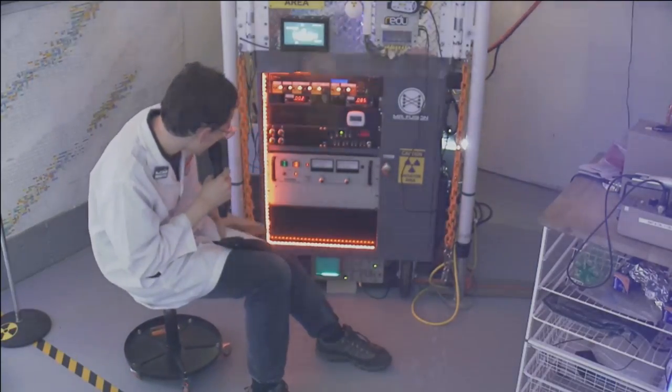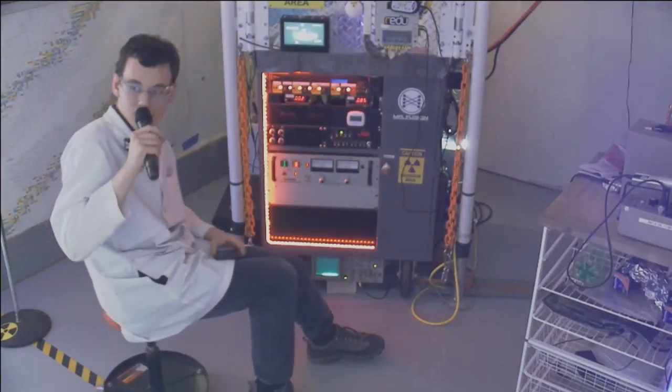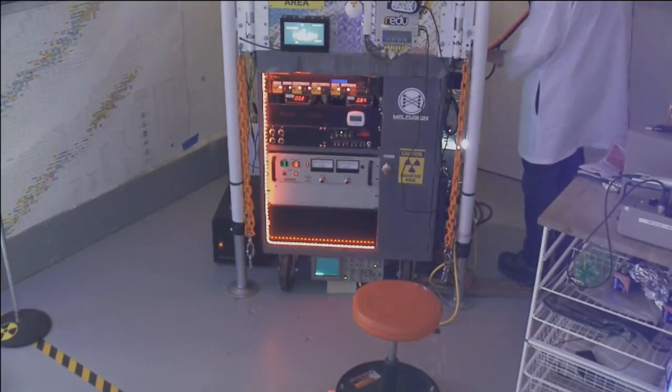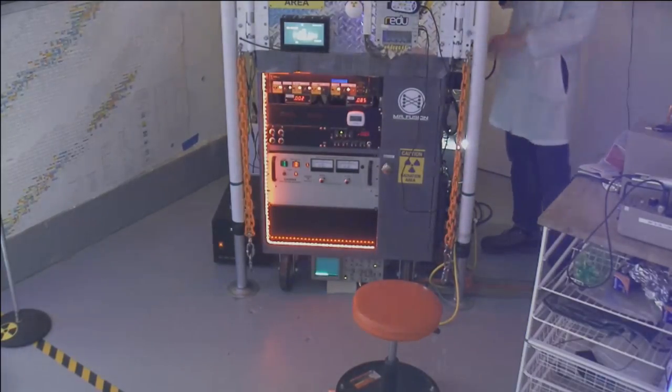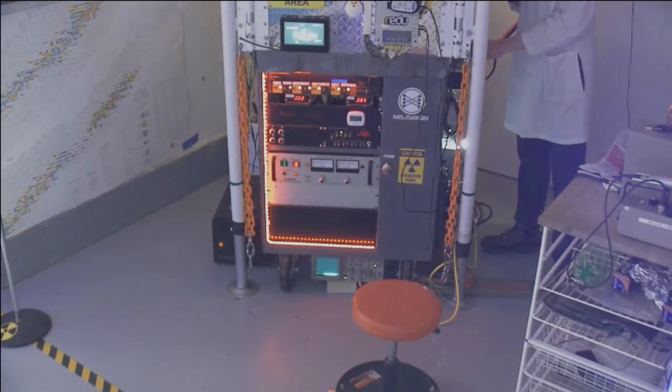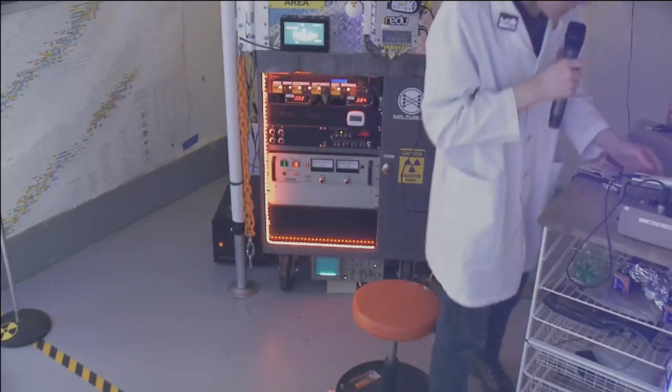That's going to clean the chamber off, and that's going to start to sputter some more. So you can probably hear the X-ray detector screaming at me right now. I'm going to go ahead and turn that speaker off. So you can see we're getting quite a few X-ray counts. Let's see here, where are we at for counts right now? Come on, reset. It's a really slow dial on this one, so it averages it out. So inside the vessel, dial is still not done moving. Got about 200,000 counts right now in there, so that's pretty respectable.